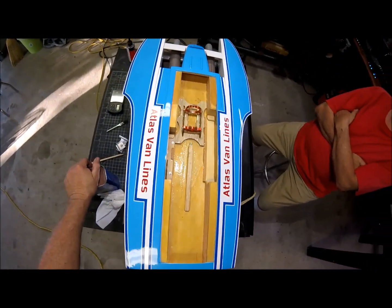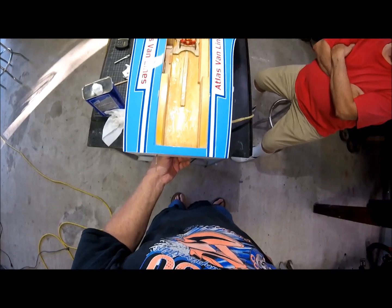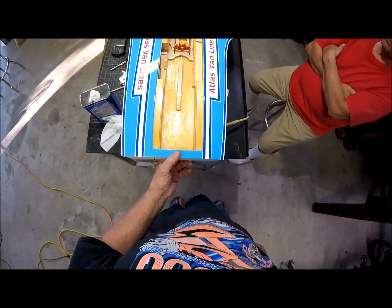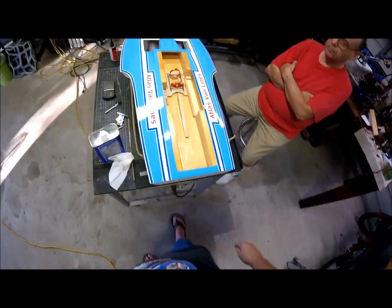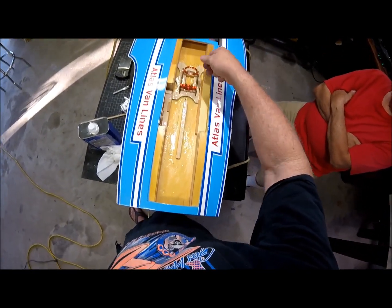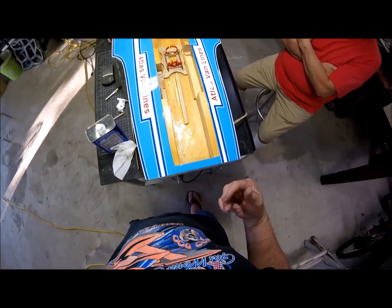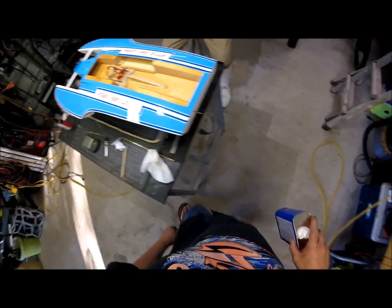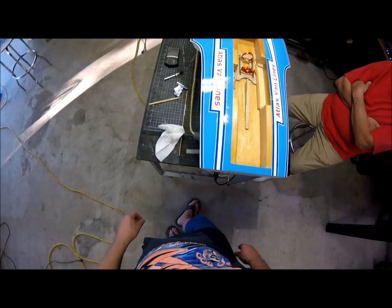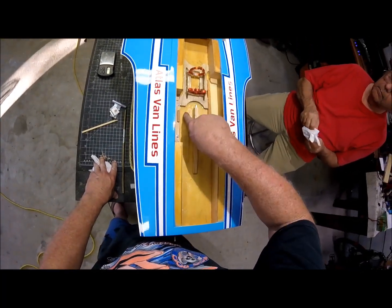Everything's epoxied in nice and good, sealed up. The stuffing tube is coming out. What we'll be doing with this is putting a quarter inch in that because the particular strut we're using is a quarter inch. The Teflon tubing or the liner will go in so far to this point, and then the rest of this will go with a piece so you can change it as you want — it'll actually be your bushing. It still has to be greased just like all struts have to be greased. We'll do another coat later on once we get everything in it. All this is nice and hard right now.